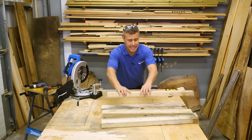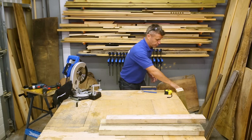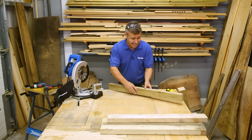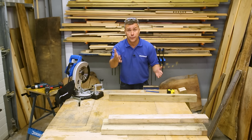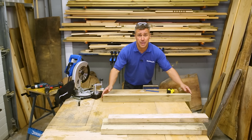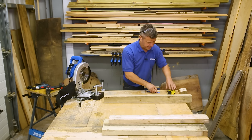That's now the four legs all cut. The next thing is we want to use a similar piece of timber — a 3x2, again it's the skids from the underside of the pallet — to create a frame for the top of the table, a rectangular shape. I'm going to choose it to be about 900 millimeters wide and about 600 millimeters in depth.